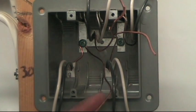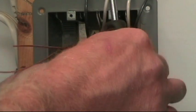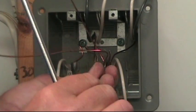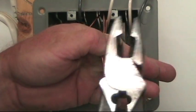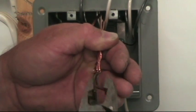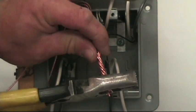As you can see, I've got that wrapped around the screw about 180 degrees, nice and snug. Now I want to splice all four ground wires together along with two pigtails to go to my switches. Here's the shortest wire of the six — I'm going to bring them all even, then cut them roughly all even. I've got six wires to splice together. Start the wires all twisting together nice and even. I've got a nice twisted pattern and I'll cut them off evenly again.